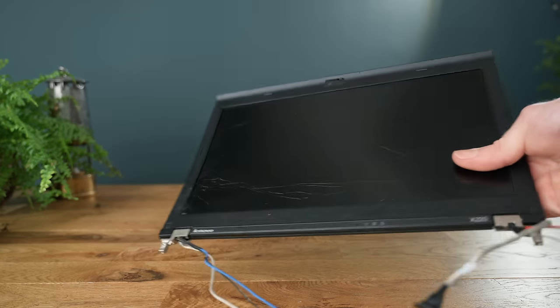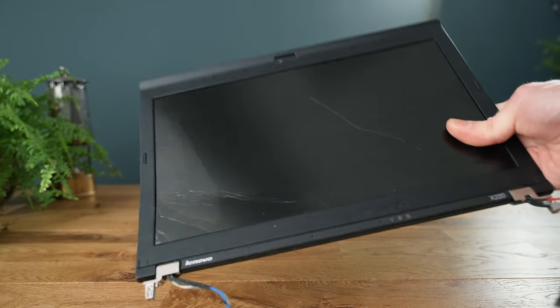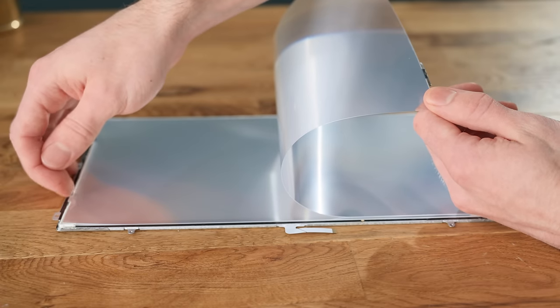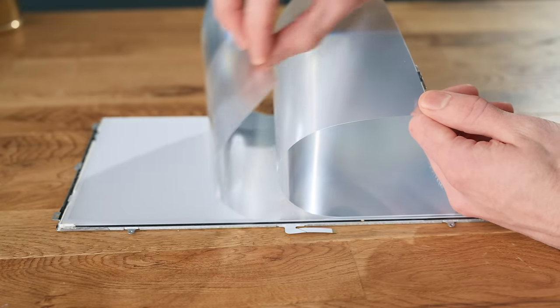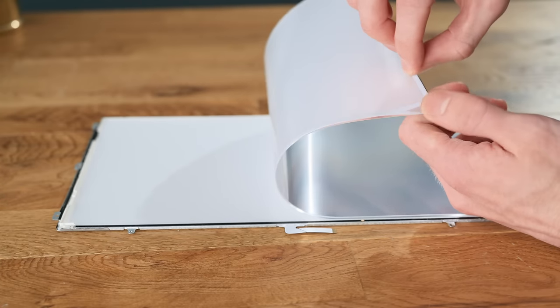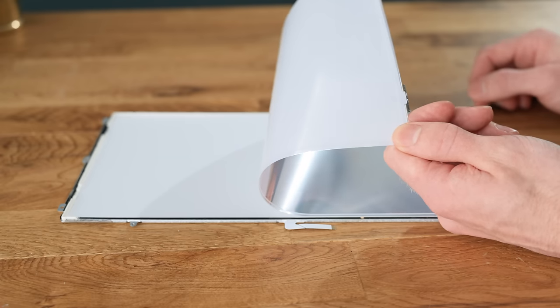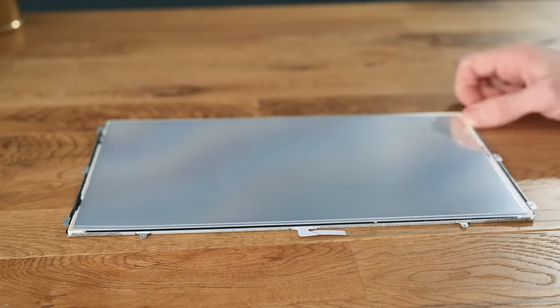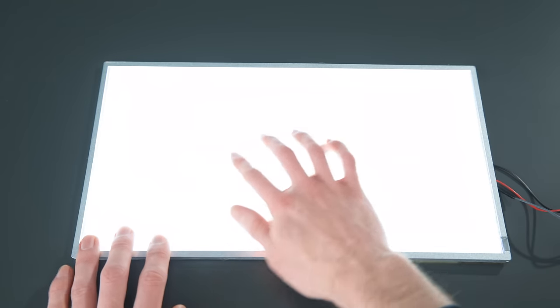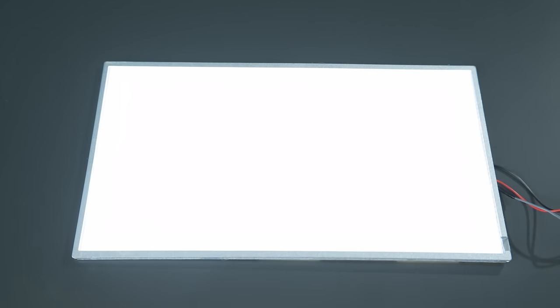While we're on the topic of lighting, laptop screens in particular are worth salvaging even if they're smashed. This is because when the LCD layer is removed, you're left with a variety of potentially useful diffusion sheets, Fresnel lenses and an acrylic back panel. These work together to spread out the backlight evenly, and to take advantage of them as is, you can leave them inside the screen casing and wire up the PCB on the back to trigger the screen's built-in backlight. This leaves you with a soft, diffused light source that you can then put to a variety of uses.